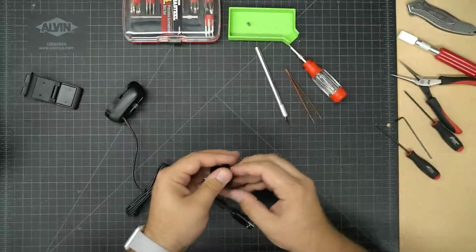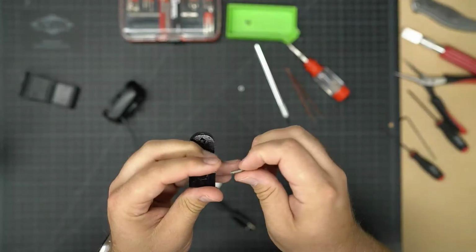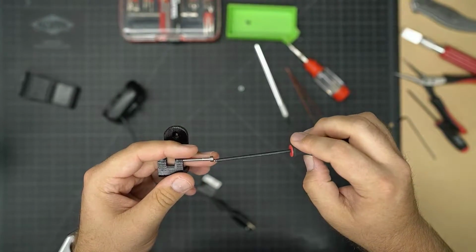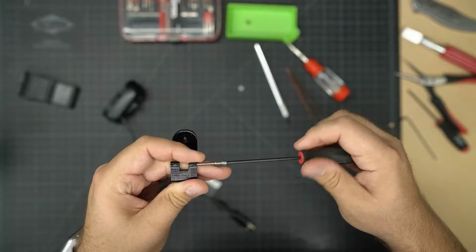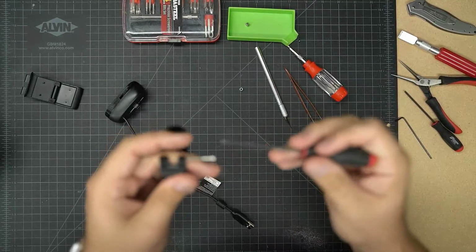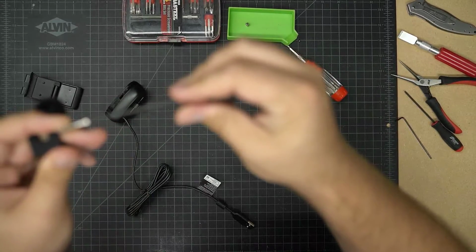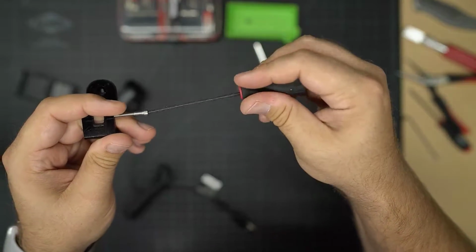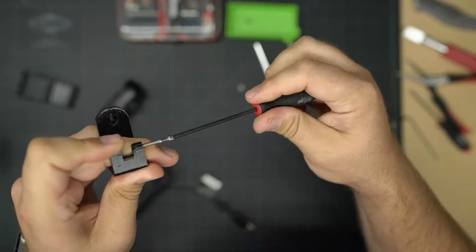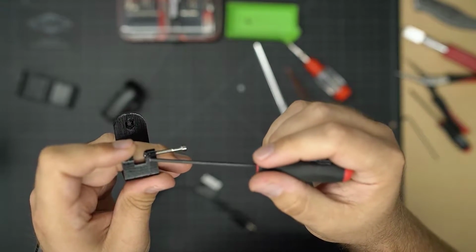And all we have to do is pre-thread a little bit. I even put a spare nylock in there, just in case. So we'll pre-thread this bad boy. And I'll get you the dimensions on this screw. I just knew what it was out of my screw bin. And all I do is pre-screw it so it gets to here. Oh, sorry, hands in the center. And there we go. Just keep pre-screwing until you get to right there, so you can start seeing a little melting.